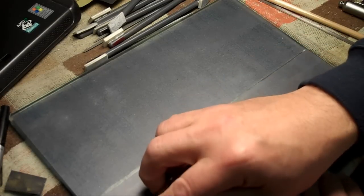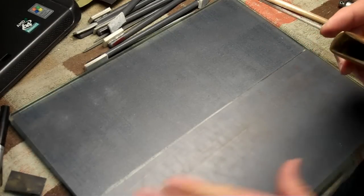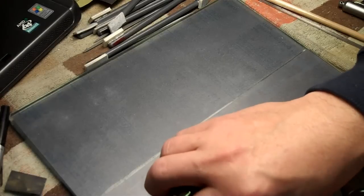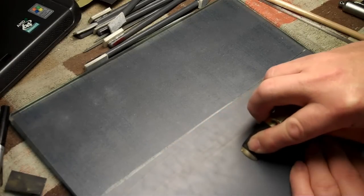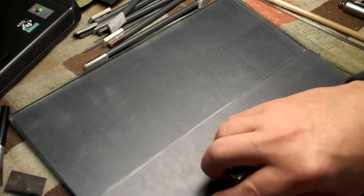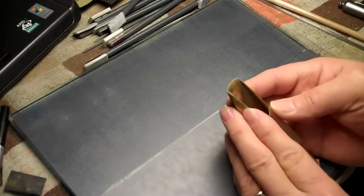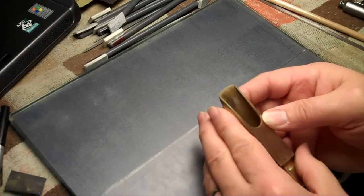I went forward until I'm sure I have it. You can also tell by the skid marks — if you've got two skid marks, you're not cutting the tip rail. If you're cutting the tip rail, you're going to see a smear down the middle. The tip rail is already getting a little wider.